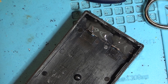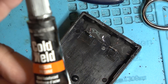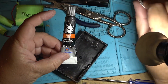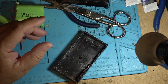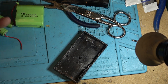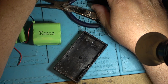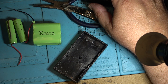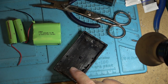So what I've done is I've used JB Weld — or Cold Weld, same thing. This stuff is called Cold Weld, steel reinforced cold weld. It's the same thing as JB Weld just without the price of JB Weld. So I've used this and I've got it set up. Once it's set up we'll attach the wires and see if we can stuff all those cells in there and see if it will accept a charge. It should, because these are nickel metal hydride batteries. They're quite similar in capacity to the originals — the original was 9.6V 1000 milliamp hour and this is 1600 milliamp hour — so we should have adequate capacity to rebuild at least one of these packs.